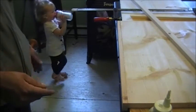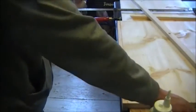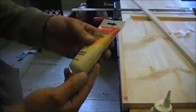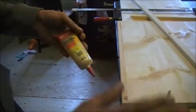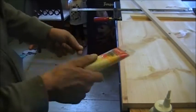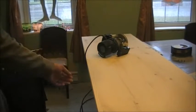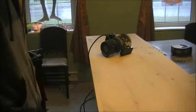That's how I do the trim on the front — very simple but it's going to look great once it's got a routed edge on it. I'll fill all the nail holes with natural wood filler, which is great for this color of pine or spruce. Then sand over everything until it's nice and smooth — you won't see any cracks or holes. After that I'll route out the edges of the table.